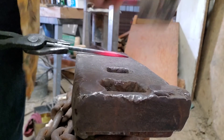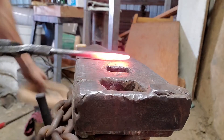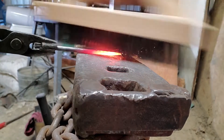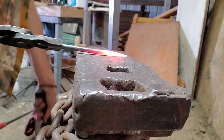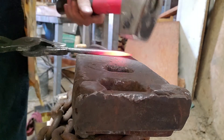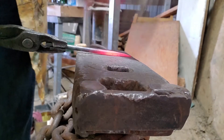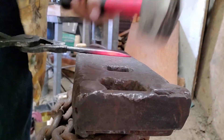You may have noticed that I keep brushing it off with a wire brush. Every time the metal is hot I go ahead and hit it with this metal brush. What that does is it helps keep back some of the scale buildup, as well as makes a better-looking finished product where I don't have to do as much sanding or filing later on.